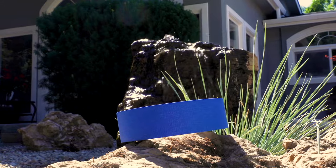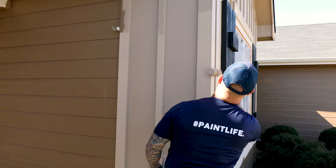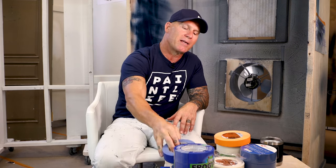Another quality of blue tape versus some of the other tapes is that blue tape is more UV resistant. So if you're masking on the outside of a house, the sun is going to be hitting the tape. The UV rays are going to cause that tape to splinter — cause the paper to dry out and just not perform as well. If I'm masking outside and leaving tape up for multiple days like a yellow or even an orange tape, for four or five days the sun's UV rays are going to deteriorate that paper, make it dry out, and cause it to splinter.